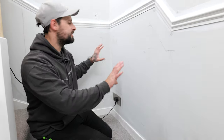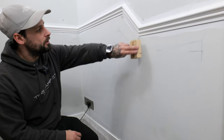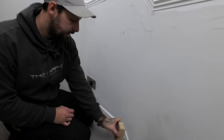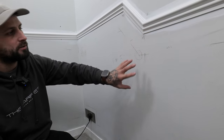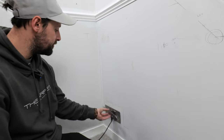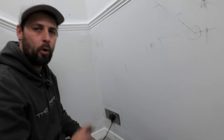Now we've moved on to slightly complicated sections where we're changing levels — this may come up depending on the panel sizes you've chosen. Get your 100mm spacer block and mark everywhere along the top, the sides, and the bottom. What you're looking for are the little intersections — you can't put a level line down because it won't be vertical here; it's not how it works. For outlets, use your angle finder, sit it on top, and mark around them to give yourself a border to butt up to. Then pull your chalk lines.